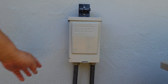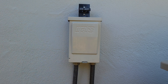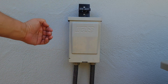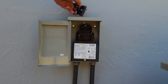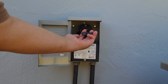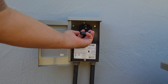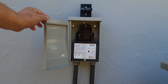To show you how the disconnect box works: it has a latch, a tab that you can put a padlock on so nobody can get inside. Pull that tab back — it's a door that swings this way, so push the door down and swing it out. The fuse will be in the on position. Pull it out, flip it over to read off. I pull it out and put it on top of the box so there's no doubt that there's no power going through there.